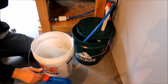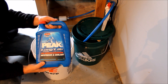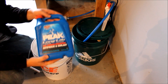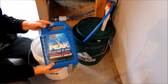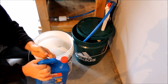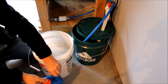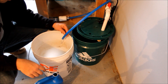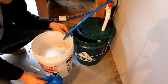I've gone around and checked for leaks, everything looks good, and the system's running. I'm going to go ahead and add the coolant - this is just regular antifreeze or coolant for a vehicle. It's expensive but pretty much necessary. I don't want the water to freeze in these lines, and I also don't want the water to boil if it ever gets that hot. This stuff keeps the water from boiling so there won't be any steam or pressure building up, and it obviously keeps it from freezing. The system took about two and a half gallons of water to fill all the pipe, so I'm going to start pumping out water and adding the coolant until I can see it coming through in my clear tubing.